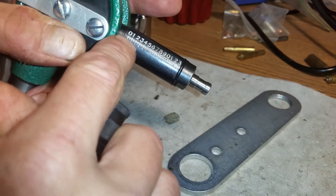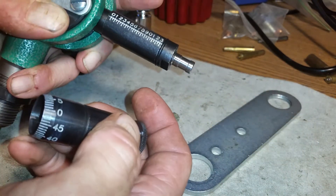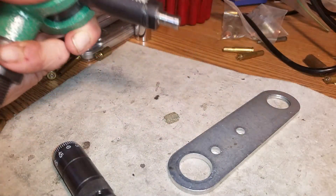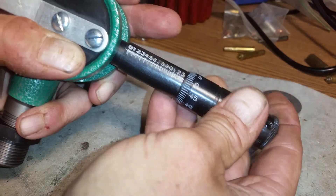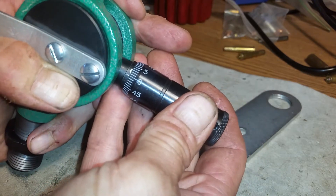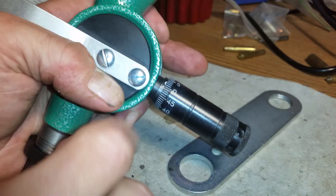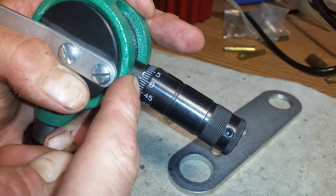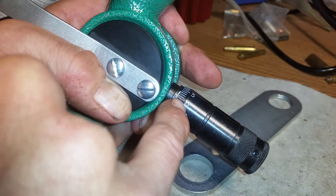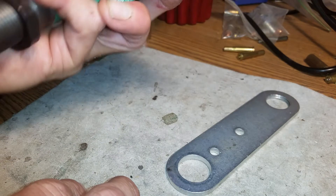Take this piece — your zero is there and there's a zero on here. Just slide it on. I also put o-ring lube on here since I had it apart; it'll just make things a little smoother. Work this back on and push your zero line all the way down and line it up with dead zero. I think that's zero — the zero index and the zero on the body index are lined up. Once you get that, that's your zero index. Then go ahead and tighten that set screw back down and you should be ready to go.